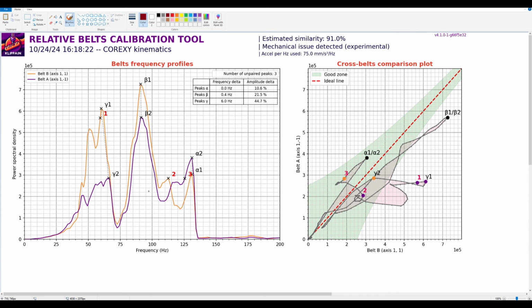Sometimes if you get a graph like this and your input shaper looks good, or let's say your input shaper looks decent, but we just can't solve this belt, it's better to start over. Sometimes, not all the time. Sometimes, if you've made adjustments and you've tightened A somewhat, you loosen B, you loosen A, you tighten, you keep loosening and tightening, eventually it's just better to start over fresh on the belt tension